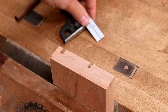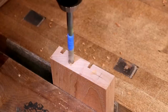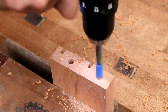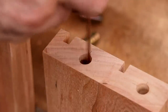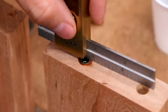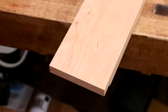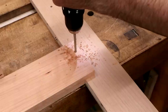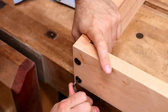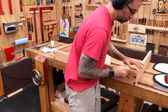On one side of the frame, the side piece will be removable, so I'm going to install some threaded inserts in the top and bottom pieces. The hole is drilled slightly undersized for the insert, and when drilling you really want to be as straight and true as possible — probably should have used my drill press for this. To make sure the insert doesn't move, I'll line the hole with some epoxy and then slowly drive the insert into place. Make sure it sits just below the surface. Using the same drill locations, I'll mark the top and bottom of the removable side piece and drill holes just larger than the bolts I plan to use. If those inserts aren't perfectly straight, this is when you'll find out — mine aren't perfect, but I pick just the right angle so you'll never know.